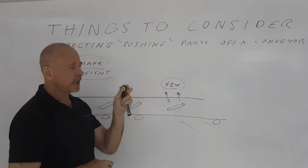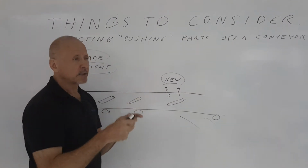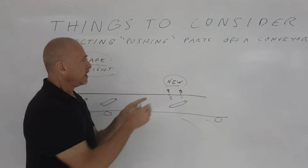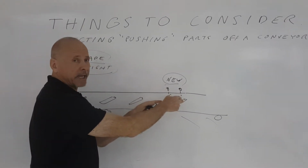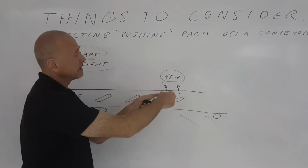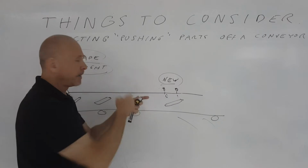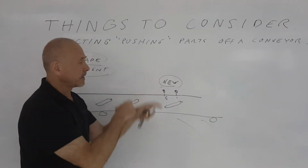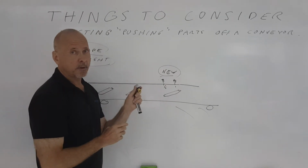So they used two air jets, and the air jets were separated by about 4 inches, the tube being about 5 inches long. You wanted to have the air jets far enough apart to hit close to the end of each tube without passing the end of the tube, and yet not too close, because then you might as well go back to that flat jet they had before and still possibly have the spinning problem. So the two air jets were able to solve the problem.